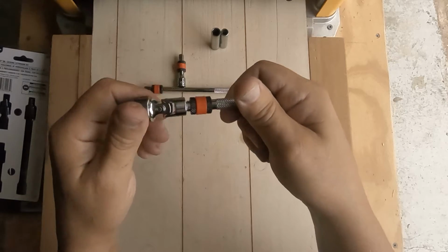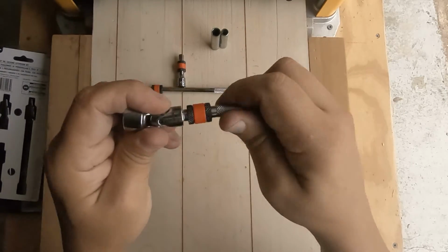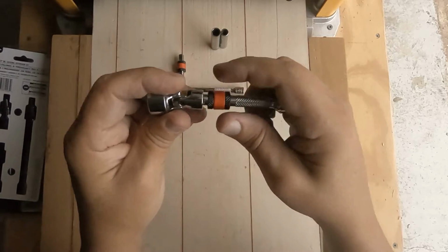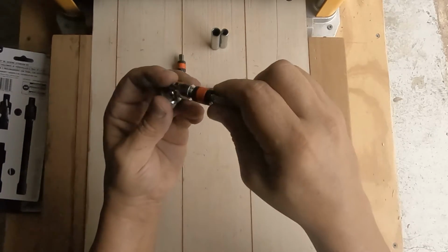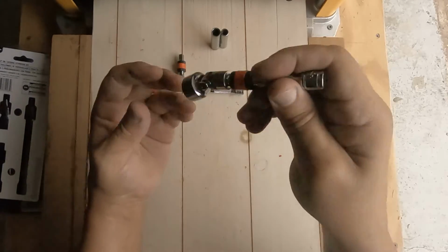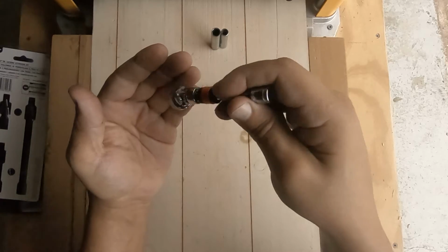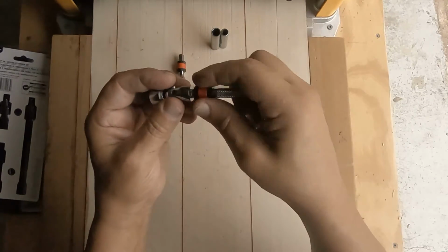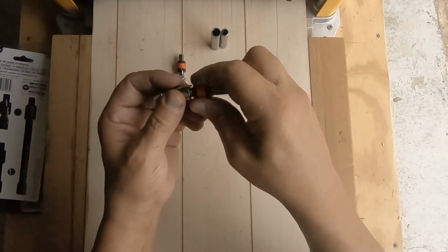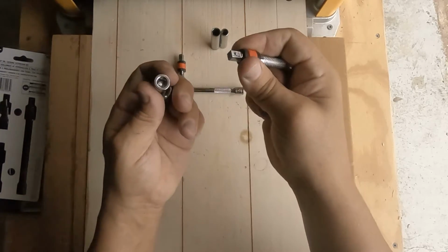And if it's machined right, it'll lock to where it will not come off. You've got to pull the collar. So now, if you're down in an area working, and you go to pull your extension up, you don't pull the socket off and leave it down in an area that's going to be tough to get to. That's what these are all about. Now you pull the collar and the ball recesses in, and then it comes right off.